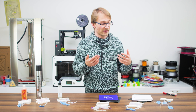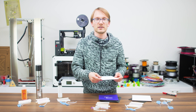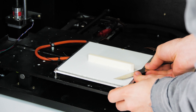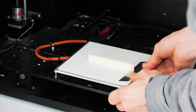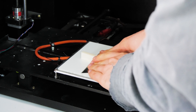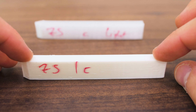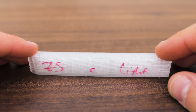It is a relatively sensitive surface that will melt when the hotend comes in contact with it, and I've routinely found the piece of paper I used to set the nozzle distance tacked to the Zebra Skin in that spot. However, it is thick enough to allow for some sanding should you ruin the top layer. Adhesion was good for all materials as long as the surface was heated. Since Zebra Skin and Plate have a significant thickness, you're also going to see a significant temperature drop from what you're reading out of the heated bed to what you're actually getting on the surface. The cold prints for PLA and PET showed a very slight amount of warp but were successful overall, while ABS onto a cold surface looks like it might work with a higher hotend temperature and a bit of a brim.